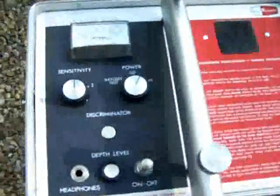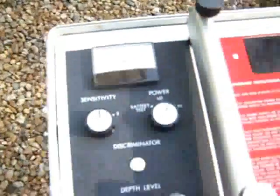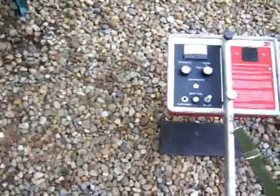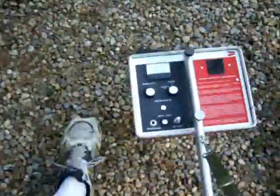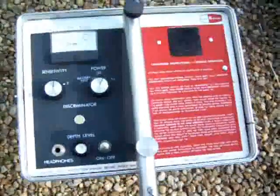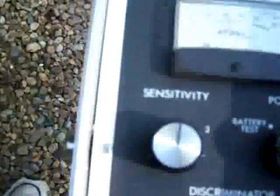I just realized the camera itself is interfering with the transmitter, and it makes sense because it's a piece of metal. So: it peaks over valve boxes and over the receiver, and peaks over the transmitter when finding cables. That's pretty much how the on-handle works. The trick is to get a nice tight null using the highest sensitivity possible, using this front knob and the receiver sensitivity.